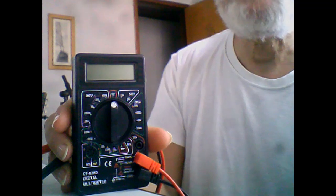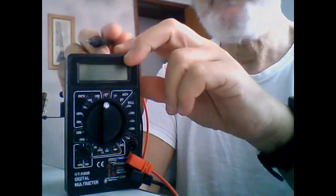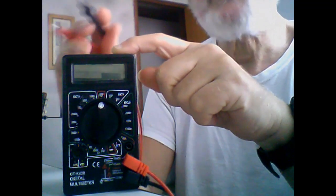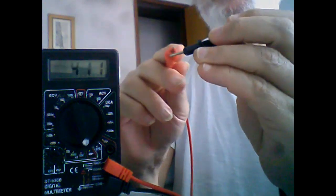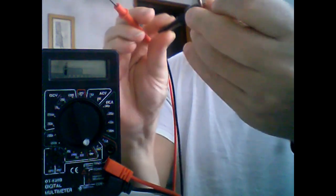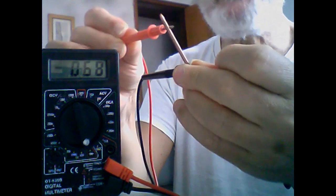Here's the equipment — it's got the probes and the multimeter. I will show how it works. Watch the sound of the buzzer when you put it in the diode mode test. I'll connect it, put it in diode mode, and you'll see that when I touch the probes it emits the signal without you having to look at the display to see if it's got continuity or not. See — if a component has continuity, it will buzz and inform you without looking at the display.